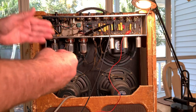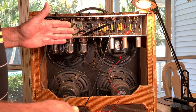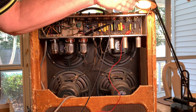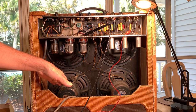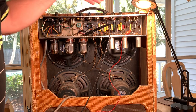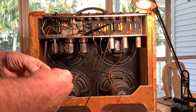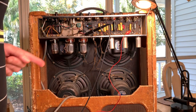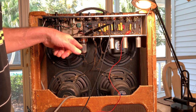You've got plumbing in your amp. The amp takes DC voltage to work, but your guitar signal is AC voltage going all the way through to your power tubes and speakers. You've got DC voltage running through all your tubes to make them amplify the signal. You need high DC voltage — with 117 volts input these were running at 450 volts DC. That's how you kill yourself.